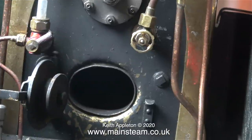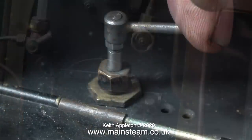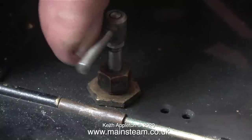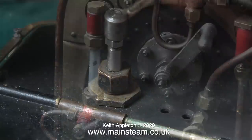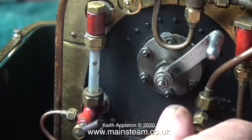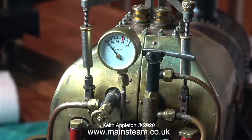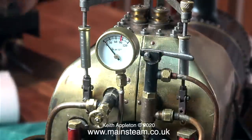Time now to take a look at the back head. The entire back head is not the boiler — it's just a brass cover and the fire hole door is fixed to that, not riveted through into the boiler itself. This little thing on the footplate is the water bypass valve — when it's open it returns the water to the main tank, and when it's closed water is pumped into the boiler. Here on the left is the water gauge, very dirty, it needs a clean. This is the regulator, or if you like the throttle, that governs how much steam is allowed to the cylinders, and the control I'm currently twiddling is the blower valve. This tap is the injector steam valve and I recognise this as a modified CME Engineering whistle valve made by my friend Chris English.